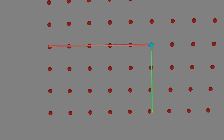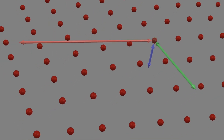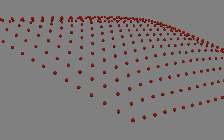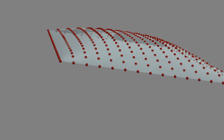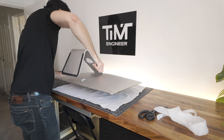The only way I could think of measuring this accurately was using a height map. A height map is a cluster of points — it's called a map because each point has an x and y coordinate. Unlike 2D maps, what makes these points special is they also have a z measurement which represents the height. If we can collect a bunch of these points relative to each other, we can then connect them in 3D space and make the contour of our iMac.